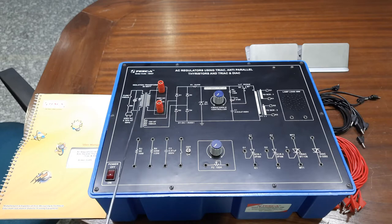Here we will describe all the circuitry on the trainer kit. We start with the isolation transformer which can bear up to 50 watts of load. The two terminals of 230 volt AC supply with the secondary of this isolation transformer are provided so we can use it in the circuit for supplying power. Then we have a UJT firing circuit which is inbuilt with a 9 volt zener diode, and a firing angle controller using a potentiometer. A pulse transformer output for both gate supplies on the anti-parallel thyristor combinations is also provided.